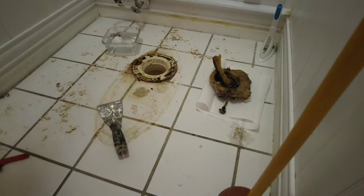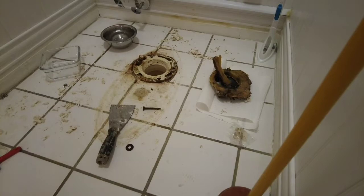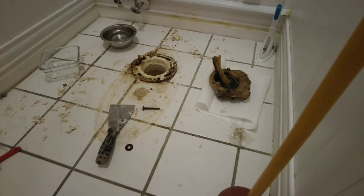Now put the wax seal down. I gotta clean these gloves off a little bit. Okay, I got this fairly nice. We're nice enough I can put the wax gasket on, a new wax gasket. I did have a little problem getting that guy on properly, once again, because this particular frame's a little compromised.